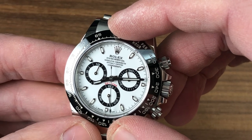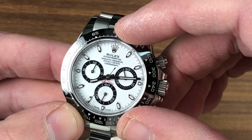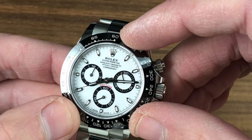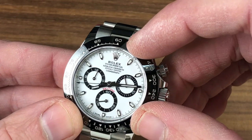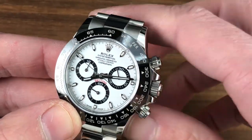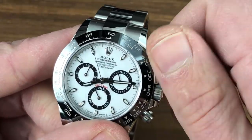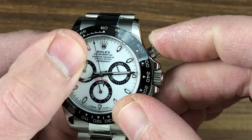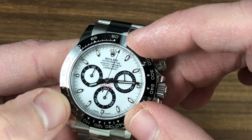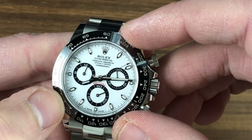With a Breguet overcoil hairspring made by hand, the watch earns COSC chronometer certification but goes beyond, as Rolex tests the fully cased-up finished watch to minus two plus two seconds per day or better — hence the superlative chronometer nomenclature. That overcoil is made of a blue-oxidized niobium-zirconium Parachrom Blue alloy that is anti-magnetic, making this a highly anti-magnetic, shock-resistant, 100-meter water-resistant watch. It features both a vertical clutch and a column wheel for its chronograph: the column wheel makes the action crisp, and the vertical clutch makes the start and stop of the chronograph seconds hand smooth. Thanks to the vertical clutch, you can leave the chronograph running full-time for center seconds, minutes, and hours without additional wear or hazard to the movement.